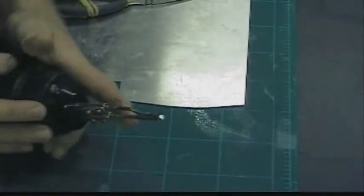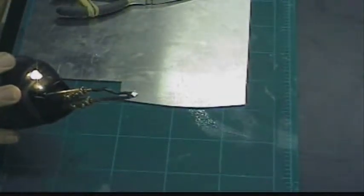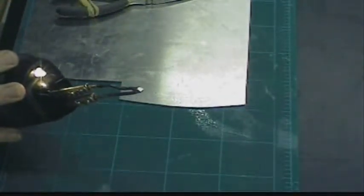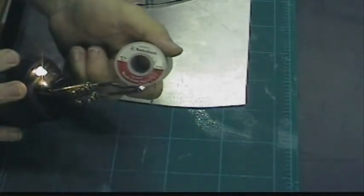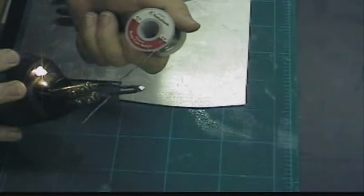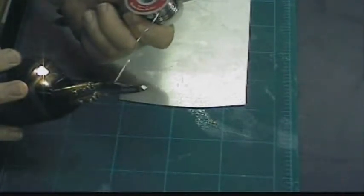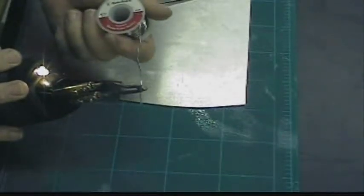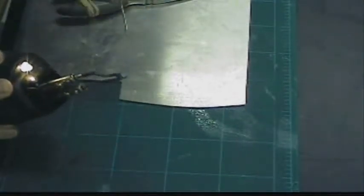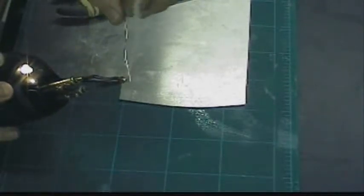You're going to have to do what's known as tinning. Now I've turned the soldering iron on. I'm going to have to get some solder — I went to the shack again and got some rosin core solder. You don't want acid core; I don't think they make a lot of it anymore anyway. Acid core leads to corrosion.